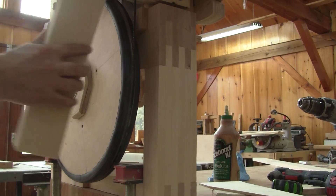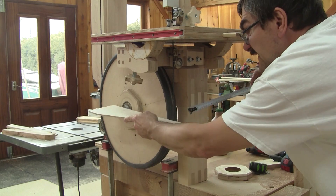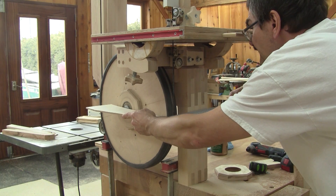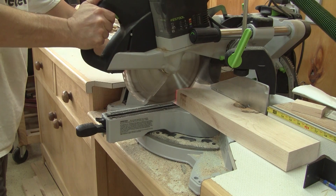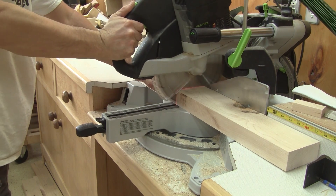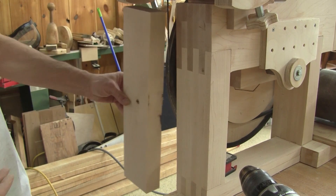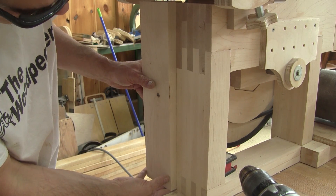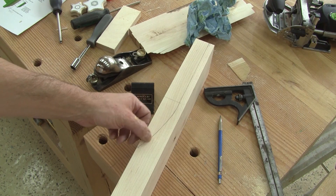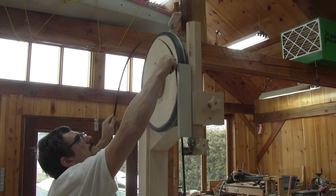Now I can work on the piece of wood which will be at the right of the bottom wheel. The first thing I do is figure the thickness of the piece. I was lucky — I had a piece of maple exactly this size on hand. I just need to cut it to length, but it's a bit too thick near the wheel. I trace the shape I want to cut, then switch to a wider blade and cut on the line.